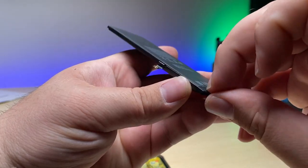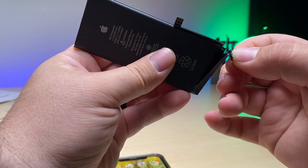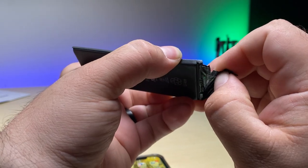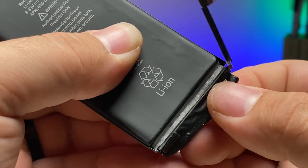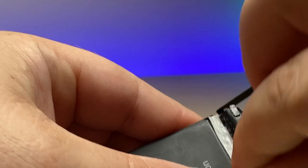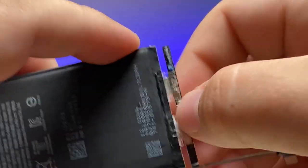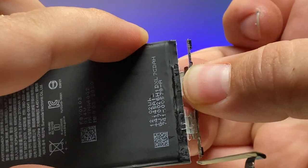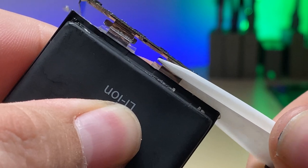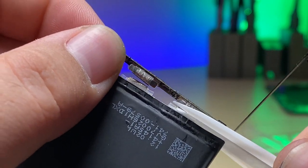I have other in-depth videos showing this entire process, but it's basically straightforward. The first thing I'm going to do is carefully remove the sticker that is protecting the BMS board — the battery management system. I can grab the second sticker and gently pull it out. As I do that, it'll kind of unroll the BMS board. Then I can remove that inner sticker as well. Just like that. And then inside here, you'll notice that there are two little hinges that hinge away from the BMS board on both of the leads that come out from the battery core itself. I'm going to carefully hinge those out. I've got here a pair of ceramic scissors that come in and carefully cut along that seam, and we'll do the same on the other side.